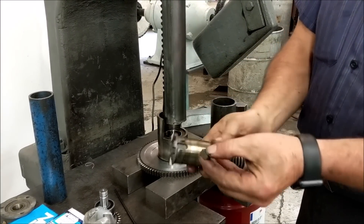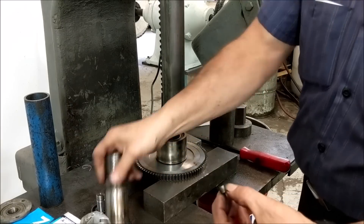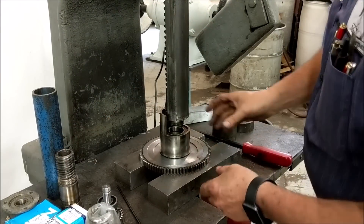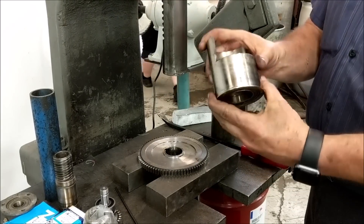So I'm not too worried about being careful with it, just go down. The key on this one just came out, which is good. Sometimes you actually have to go over and put it in a vise and pull the key out, but you want to take your key out and set it aside — you could be putting it back in your new gear.